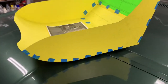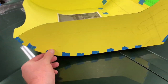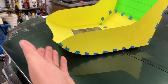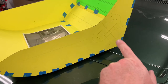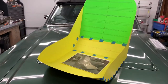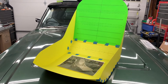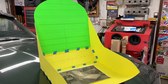The sides are basically going to get a piece of angle that goes all the way down the bottom and up the back. I'll have to use the shrinker/stretcher to put that curve in it, and probably pie-cut and bend and weld just the corner — it would be a lot easier to weld it all together. But I think to do it right, to have it look right, it's got to be riveted together. Anyway, what do you guys think — do you want to see it?